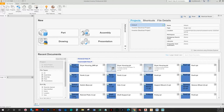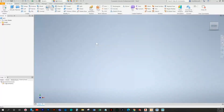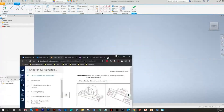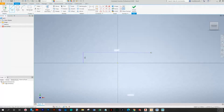Hey everybody, today we're going to work on Chapter 12. The first part is the motor housing. The best view for this would be the front view, so we can draw the profile and then extrude-cut off this portion. I'll go ahead and draw that — as always I'm just going to ballpark the size and then get into the details later.